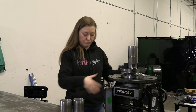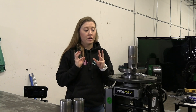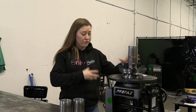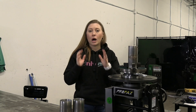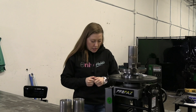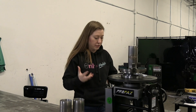So many people are asking how you set up the speed on different turntables. There is no formula for that. Basically what I do — I'm going to be honest with you — I just eyeball it and I make my setup based on the way the weld looks, because every positioner runs differently. It's hard to say this diameter is good with this RPM. For me it's easier to show you how I do it, because I'm not familiar with this positioner — it's literally my first time using it.